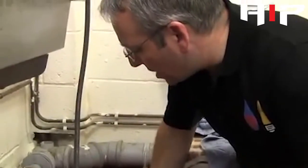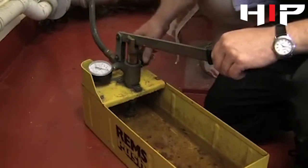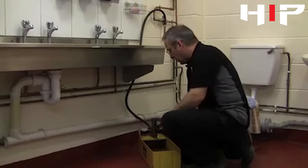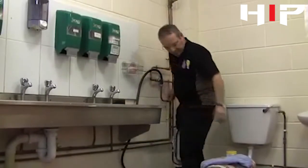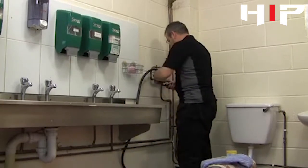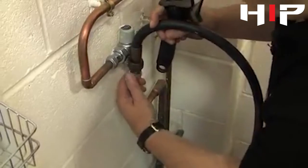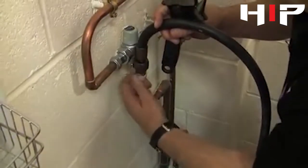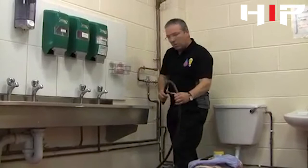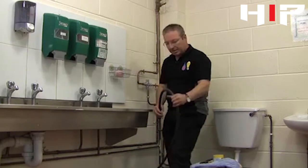That's now gone and the pressure is still four and a half bar, so we're quite happy that that pipework is safe and sound — no leaks. We'll release the pressure and disconnect the hose. We're quite confident now that it can work at three bar pressure, and we've tested it up to four and a half bar for over an hour, so we're confident it's okay.